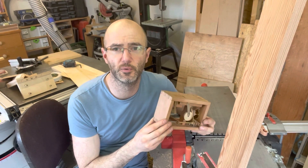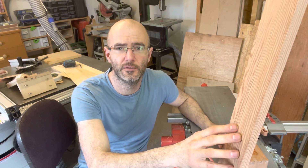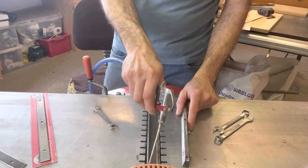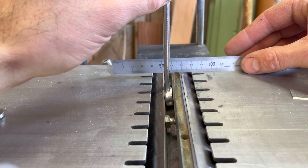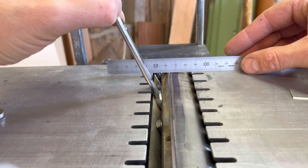For the magician automata, I've got this lovely bit of Douglas fir here that I'll be using. But first of all, I do need to change the planer blades. What I hadn't realized is the planer thicknesser doesn't like planing paint, and it almost instantly dulled the planer blades. So I need to change those over now.